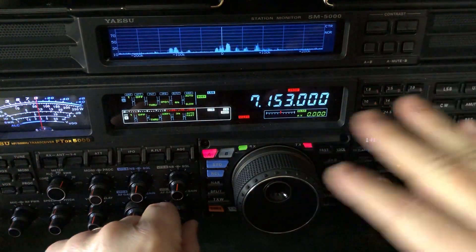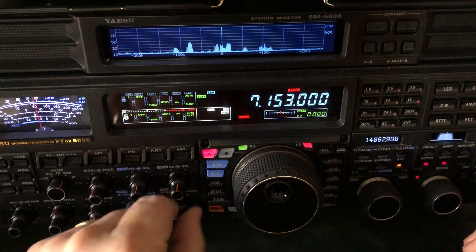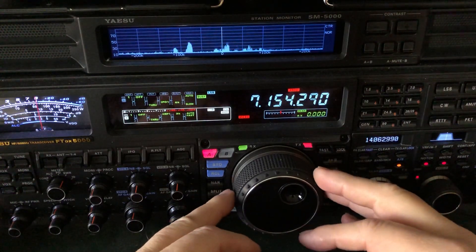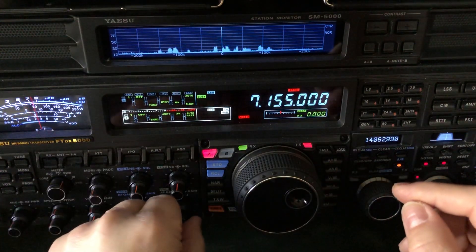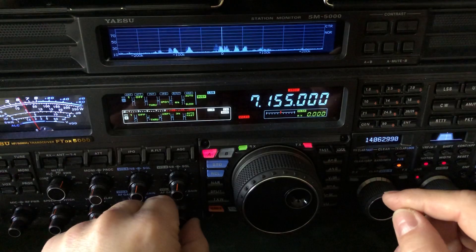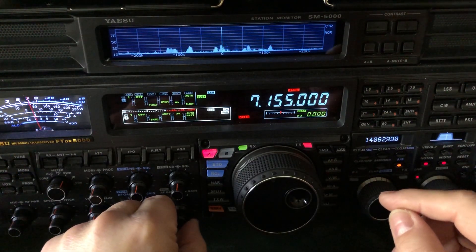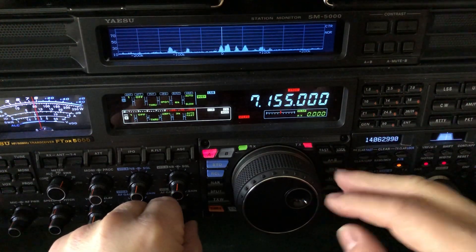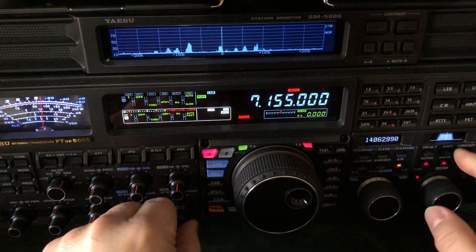The gentlemen's and lady's agreement has always been: let's give three kilohertz, because it takes three kilohertz for the human voice to sound good on sideband. So whatever happened here, I encourage you — if you're new to amateur radio, please avoid this. You don't want to get labeled a lid. It's a derogatory term for a ham radio operator who isn't acting nice. And because of people like that, we need to deploy the advanced features we have available in filtering and DSP.